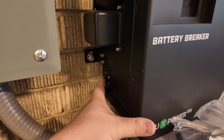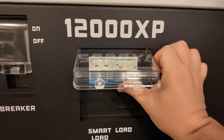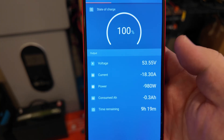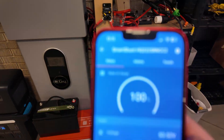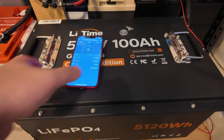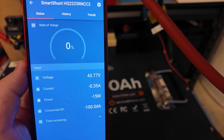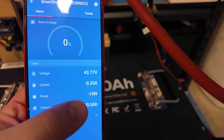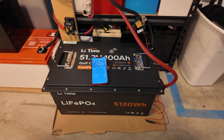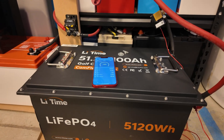Let's go ahead and flip the 12,000 XP on and energize the load. We're pulling negative 18.3 amps — an exact 0.2C rate would be about 20 amps since this is a 100 amp hour battery, so we're very close. I've paused things temporarily here to show that we've pulled exactly 100 amp hours. Voltage is dropping pretty quick at 43 volts, so it won't go much longer, but it totally passed its capacity test. It has protections built in so it does not discharge below a safe voltage to protect the cells inside.